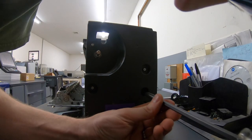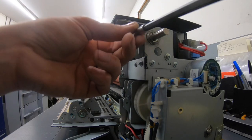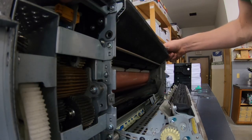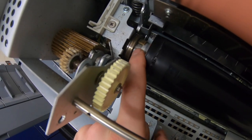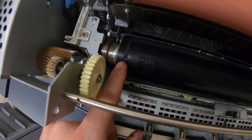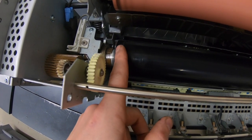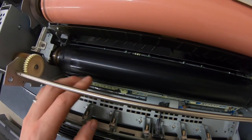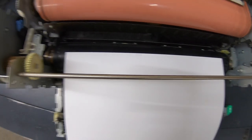There's got to be another one here — there you are. Now she's open. You can see the broken sleeve here and how loose this is. Now, this marking here — that's no big deal. Number one, it's the bottom roller, which is never going to contact toner that is not fused. And number two, it's outside where your sheet is traveling — here's a thirteen-by-nineteen inch sheet and you can see how much inside the edges it sits.